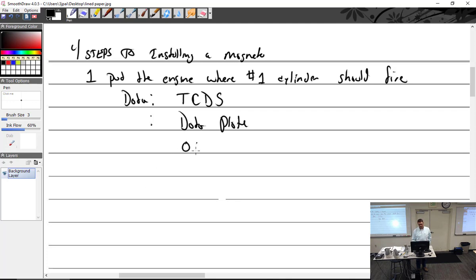Okay. Some POHs have it. Overhaul manual. It's not the pilot operating handbook, it's the engine operating book, which is confusing. So overhaul manual, service bulletin, service instruction, and the M-0 manual. That's for Lycoming. I'm sorry, Continental. Continental's is the M0 manual. All right, so these are some good sources right here.